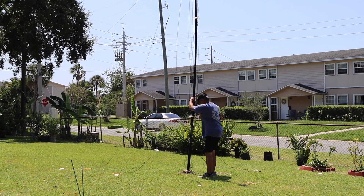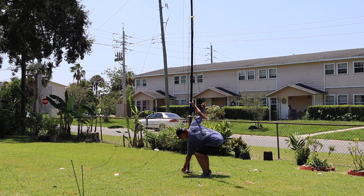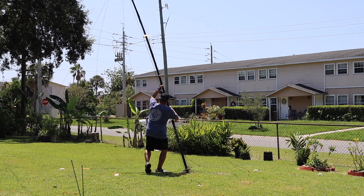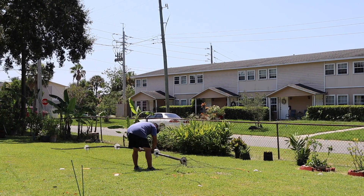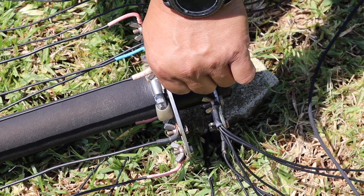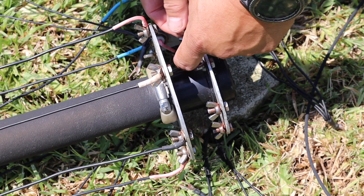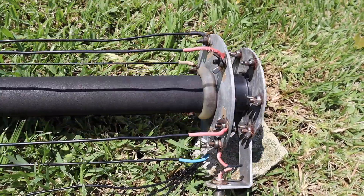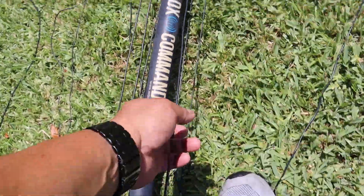I forgot — I've got some stakes here on the ground, I'm going to remove these. I should have done this first: remove these grounding radials. This one here I'm going to remove completely. I had an issue with the 40 and 15 meter element, which is this one here — just going to follow it up.